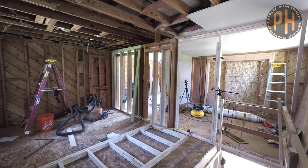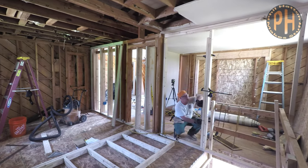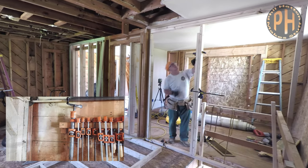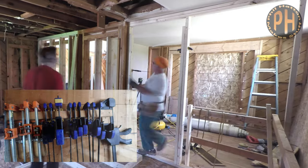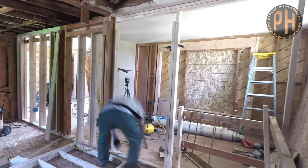If you've watched my channel, you know my opinion about clamps. You can never have enough clamps. But in the case of rough carpentry, you actually only need a few. I found that a short pipe clamp was helpful in forcing warped studs together so they were straighter. They also help you when you don't have someone to hold on to studs or other lumber while you bang in the first nail or two.